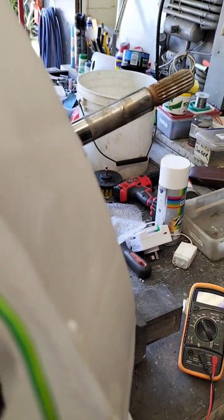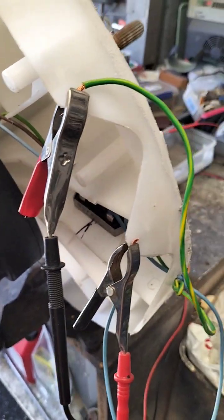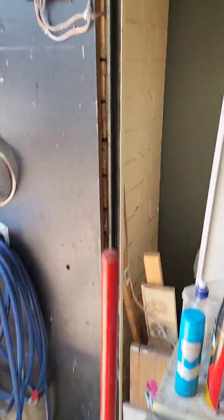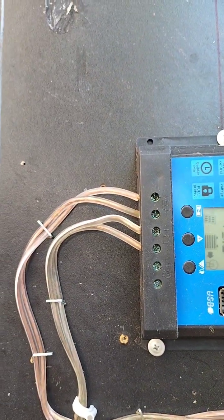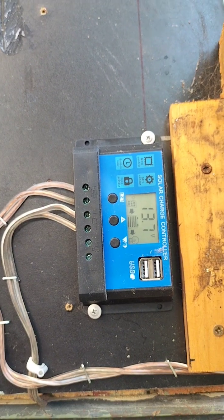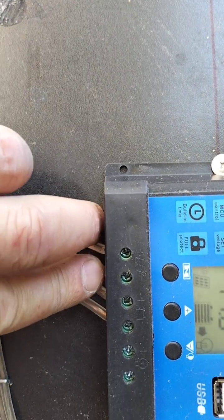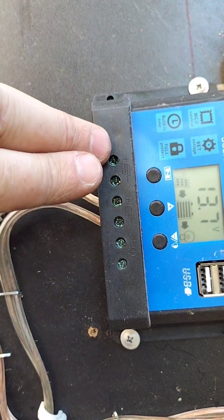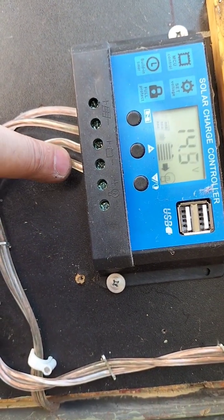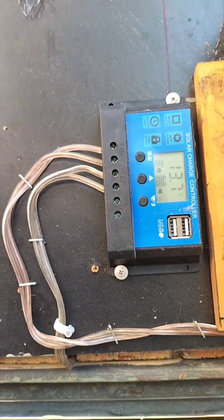Now what we've got to do is take these two leads that come out of the rectifier and put them through either a PWM controller or MPPT controller. That will look a lot like this, because that's one of my solar controllers. This one is rated at 10 amps off memory, but you can get them up to 30 or 50 amps — the more you pay, the more amperage. What that will do is let you put the input of the wind generator into there, or combine it with the solar panels, and this will be your output to the battery. It'll open and close the voltage as it's needed.